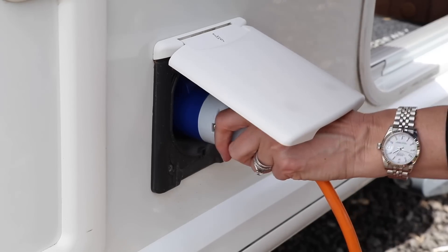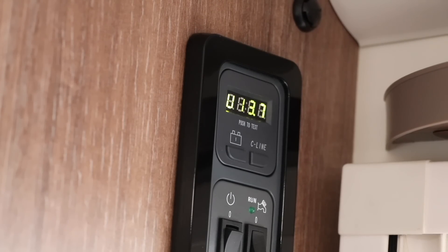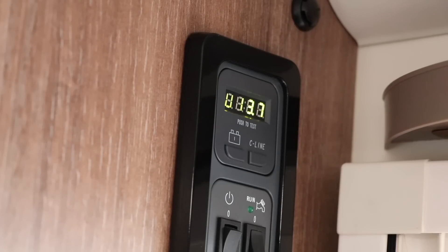A big question that gets asked a lot about solar panels is: what happens to the solar charging when you're on electric hookup at a campsite? It's really very simple and quite clever. Remember how the controller tests the voltage between pulses on a PWM controller? An MPPT controller constantly tests the voltage of the battery. If either controller thinks the battery is fully charged, it will stop sending power. This is handy in our application because when we connect to electric hookup, the onboard battery charger kicks in and trickle charges the battery, giving it a constant voltage of around 13.7 volts — making our controller think the battery is fully charged so it won't send any further charge.